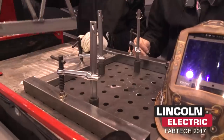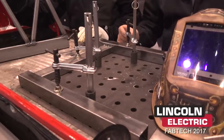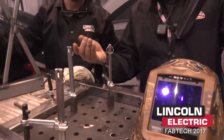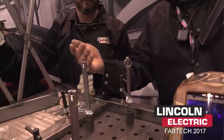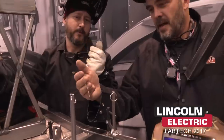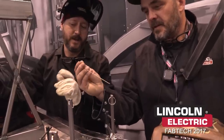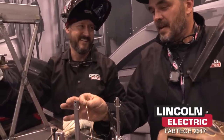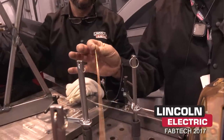Right on. How thick is your TIG wire? I'm using the thin wire right there. That's 16? Yep. And how's your method? I'm practicing that. I'm the worst at this. I go back and forth from doing this and dabbing. It depends on the corner and the angle. I keep moving it in until I'm holding like a half inch piece. Now it's like a test of how much heat I can take on my fingertips.